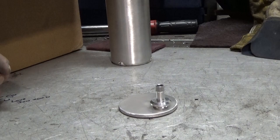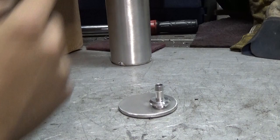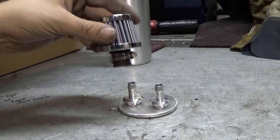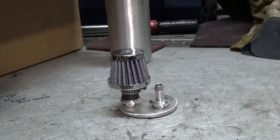I'm going to set up this top cap here. I have a couple of three-eighths hose barb weld bungs and my filter. This fitting will be the inlet, so that's going to get your oily air mass coming in to the catch can up top. This one will get welded on and my filter — or breather, it's more so a breather vent — will be stationed right there. I'm going to drill those out and we'll get going on the rest of it.